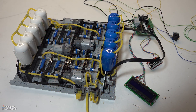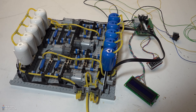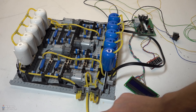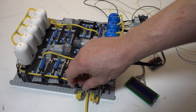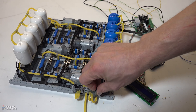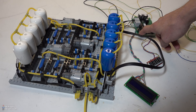Here we are and this is the compressor. On the left side there's one part and on the right side there's also a part. I can operate this as just one big compressor or as two smaller compressors with their own set point. The outgoing line from each compressor goes to a set of valves and they end up together through a tee piece to the outlet where you can hook up your installation. If I want to use it as two separate compressors, I switch these two valves and the air from both compressors is guided to the two separate outlets. I need to tell the software too, which is why I installed a jumper setting.